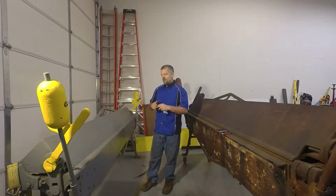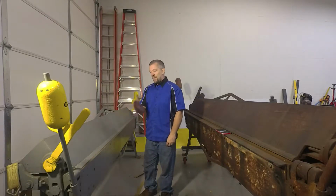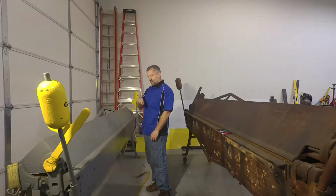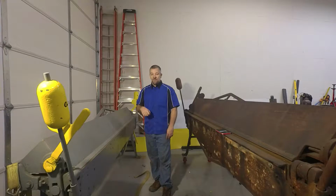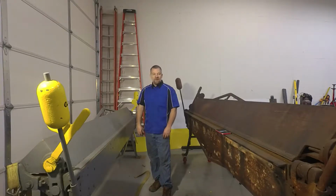The metal will be bent really nice, like if you're doing a 90, it'll be a 90-degree square on this end. But when it gets to the middle, it will still be bowed out a little bit. So when you set it on the floor, it'll teeter or it won't stand up straight. You'll have one end or one of the edges off the floor.